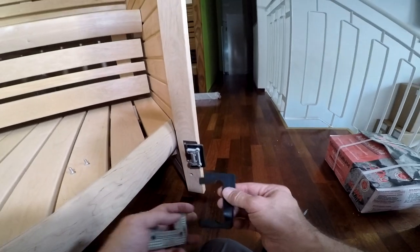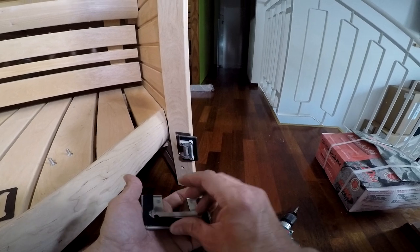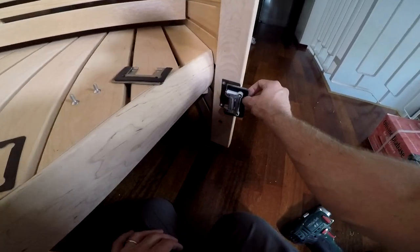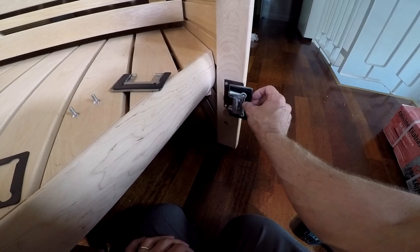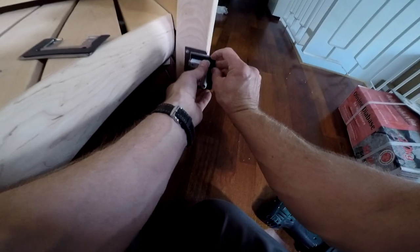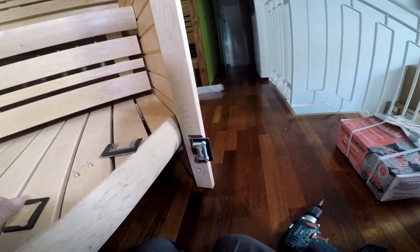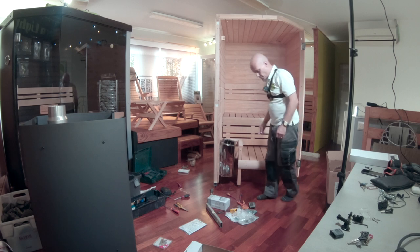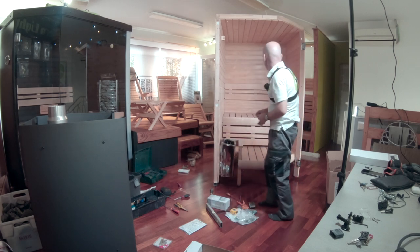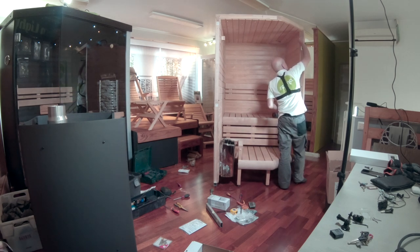What I'm gonna do is I'm going to take this one thin slice off. There's just plenty of rubbers in between here. Actually, I could even take 2. This is meant for different thicknesses of glass, and we have 8mm glass, which is really thick. And those extra rubbers are meant for thin glasses. By the way, let's put the wood plugs in now. After we put the glass on, we don't want to be hammering close to the glass. So much easier to put these plugs in now.